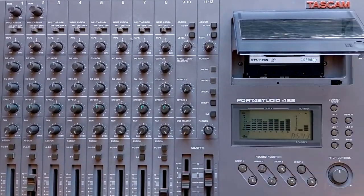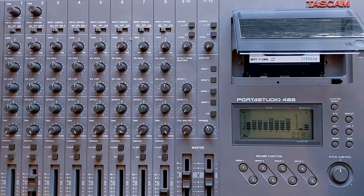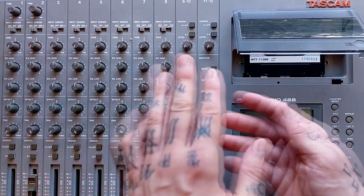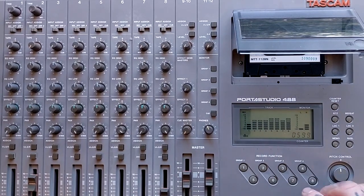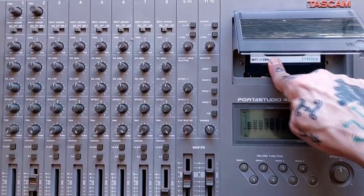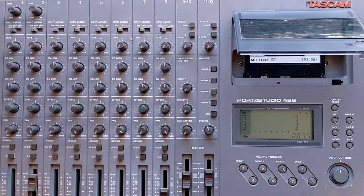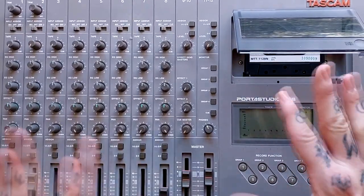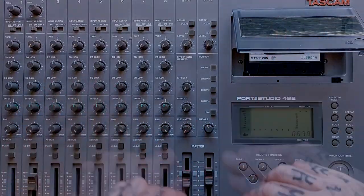If I push the cassette up against the head, we're getting something a bit closer to what it was like when calibrated. And this really throws the calibration off because the only way to do calibration on this unit is to have it propped open to access the trim pots - which is different contact than when the case is closed. Be aware of that if you've got a unit with those sorts of problems. I've just pressed play - I was getting paranoid but actually it had just come to the end of the tape. Anyway, I hope that was helpful. Thanks for watching - hope to see you again soon.